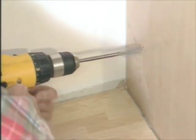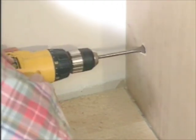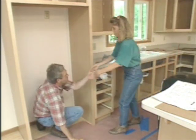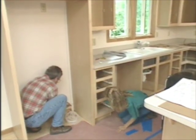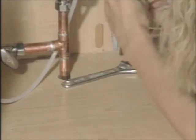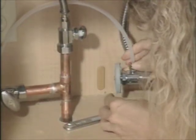With the drain assembled, we drilled the holes we needed in the cabinets to run the dishwasher supply line and drain hose. We also drilled the hole through the refrigerator panel for the ice maker supply line. For convenience, we ran the ice maker supply before putting in the dishwasher. We used plastic tubing, which works like copper, but you do need to insert a metal sleeve into the tube to keep the plastic rigid in the fitting.